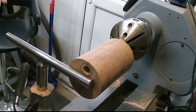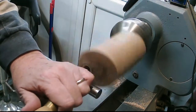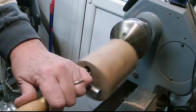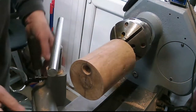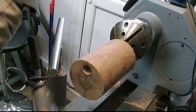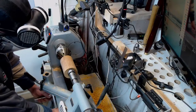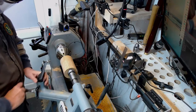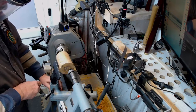I'm just going to dress the inside of the hole very carefully with a small skew and possibly a spindle gouge, just to get a little recess of half a millimeter down the inside of that drilled hole. Now I've got the inside trimmed out to fit the plastic holder, I can center it up again using the tailstock and get on with turning down the outside diameter.